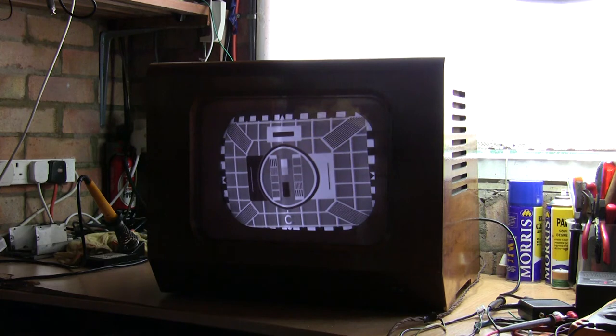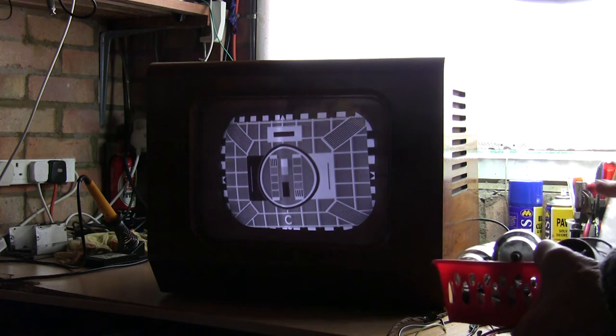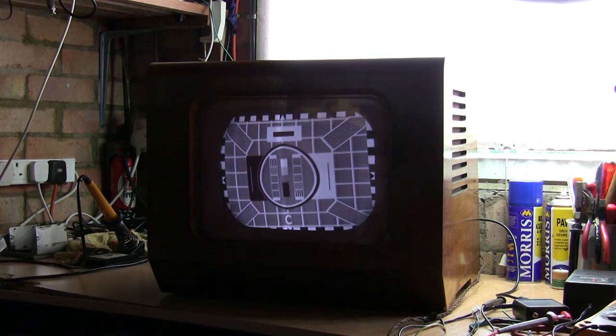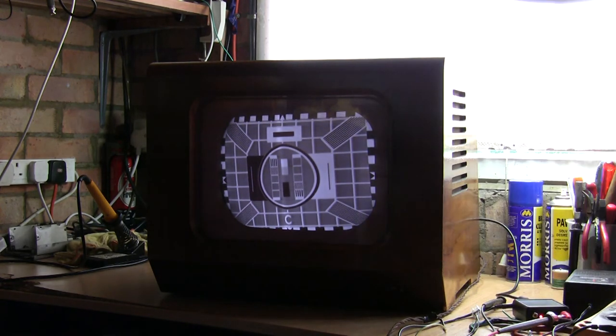I might invest in, or try to find, a better replacement — I might even have one if I dig deep in my collection. There are two components in this set called metrosils, both slightly different in design — both little red discs with two-pronged electrical connections, a bit like a capacitor. One had gone completely open circuit, so I've worked something out for that and it seems to be working. I've left the other one in but have my doubts whether it's any good.